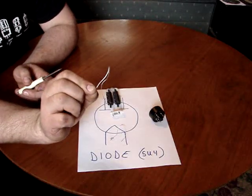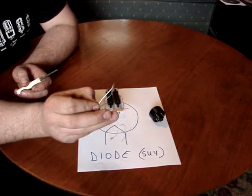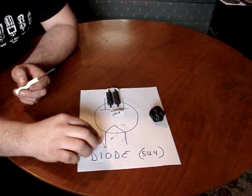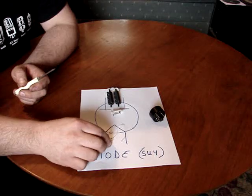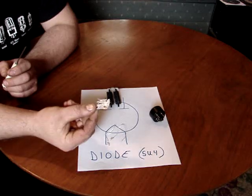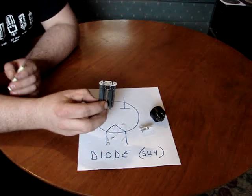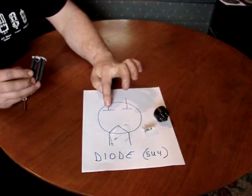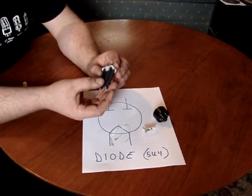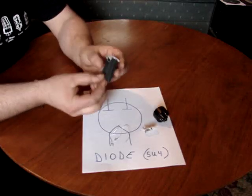I don't know if you can see it, but this is a whitish colored coating on this flat wire. That's what helps release the electrons, and it's also basically a directly heated cathode. This is a piece of mica insulator that holds the parts of the tube together, and this part is actually the plates. These two plates here, this black part of the tube, are made out of metal, and they're connected in the circuit by the two leads coming off here in the schematic.